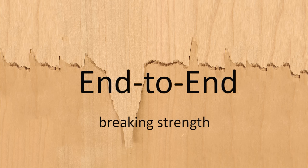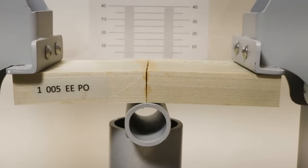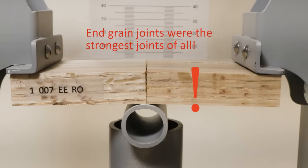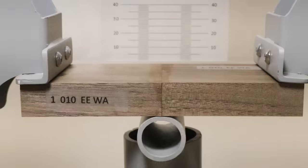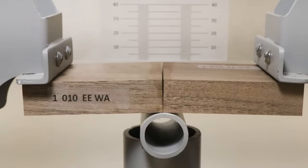Now, the critical measurement: joints glued end to end. In every case, the glue line actually fractured and the wood itself remained completely intact. And now a big surprise — the force required to break end grain joints was considerably higher than the force needed to break side grain joints. Instead of being vastly weaker, as we've been taught, end grain joints turn out to be about twice as strong as side grain joints on average.